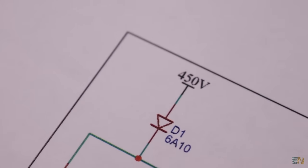Now we can solder the coils, so measure the wire length and clean out the enamel from the wire. Then you cut it to size and solder this coil on its holes. Now we can measure the LED and the phototransistor height and solder them in place so they will be at the height of the coil tube.